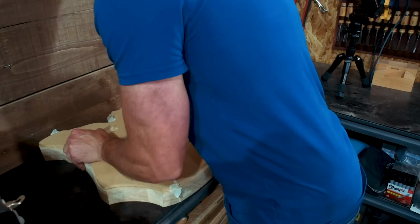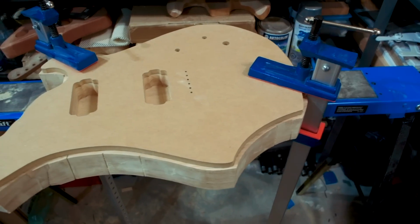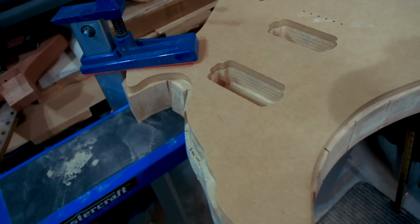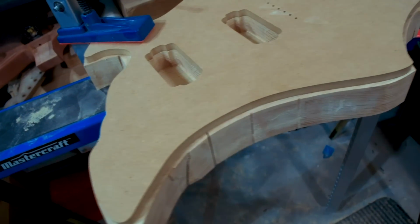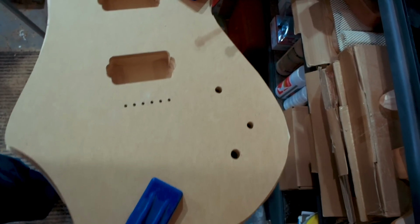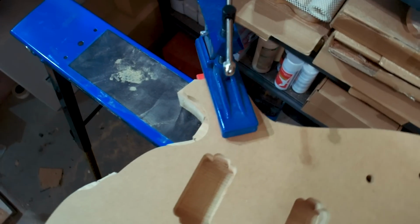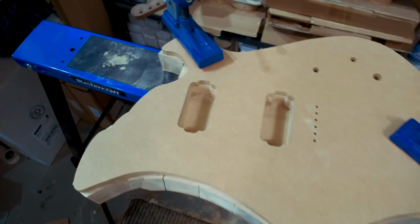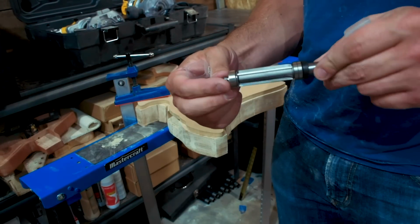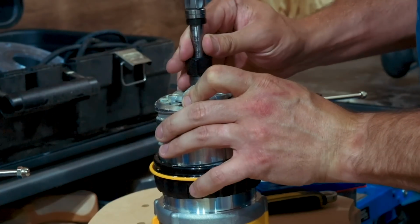Anyway, so I get this template secured in place, and I'm going to be using a long double bearing router bit for this that is specifically designed for doing guitar work. Actually, it's made by Radian Tools. You can check them out. They've also sent me a surfacing bit. Great tools. I've shown them a couple times now, but this I think is the first time on my channel that I've shown actually doing a full guitar body like this. Yeah, it would be the first time where I'm taking out the shape.